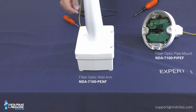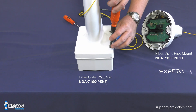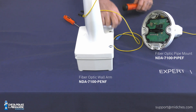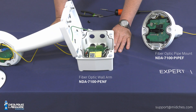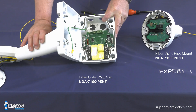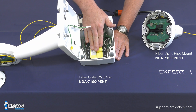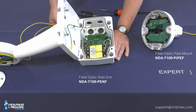Accessing the security cabinet from the arm is quick. Gen 4, Gen 5, and the universal brackets all use the same back box — the arms themselves are what differ, making the retrofit market as simple as possible. This unit happens to have a 110 power supply with a step-down transformer — it takes 110 on one side and steps it down to the other. If it's a 24-volt box, the transformer is gone and there's a small black jumper cable across that configuration. That's how you can easily tell a 110 box from a 24-volt box. Conduit adapters are available: two in the back, two in the bottom, two in the side.